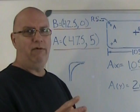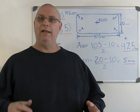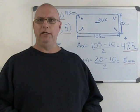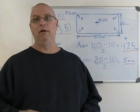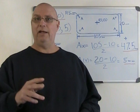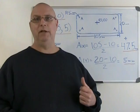So we're really looking here at three different milling operations. One major roughing operation with our 19 millimeter or 3/4 inch tool. One secondary roughing operation just to eat out the corners with our 10 millimeter finishing tool. And a final finishing operation with that same 10 millimeter tool. So we're almost ready to go, so let's get over to the mill and start our work.